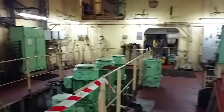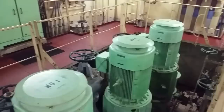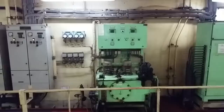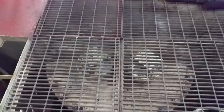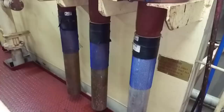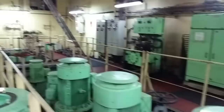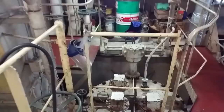These are the three salt water cooling pumps — on that little deck above we saw the fresh water ones. That's a controller unit for remote-operated valves, and a hydraulic unit to control those valves remotely. This is the starboard main engine sea chest section — you can see the anodes on top, three of them, with three spares right there. There's also a port main engine seawater suction over here, also with three anodes and three spares. That's the main sea suction — where the salt water comes into the ship from the sea, your main water for cooling.